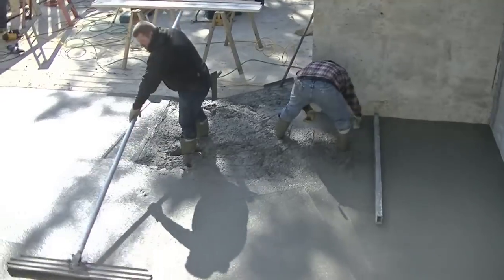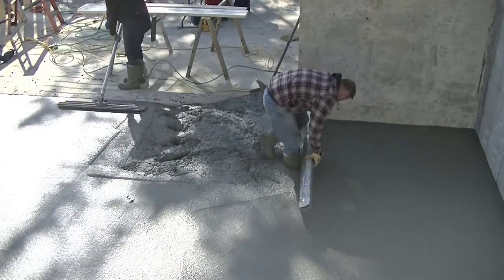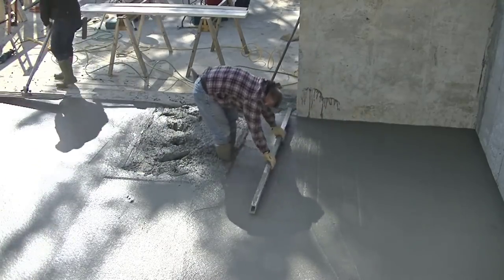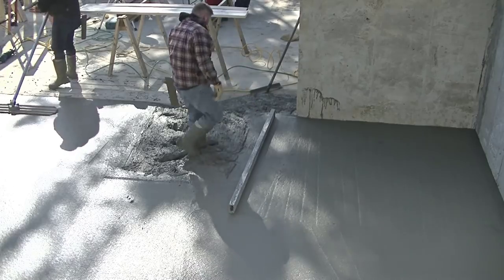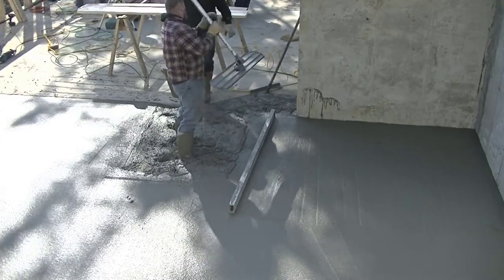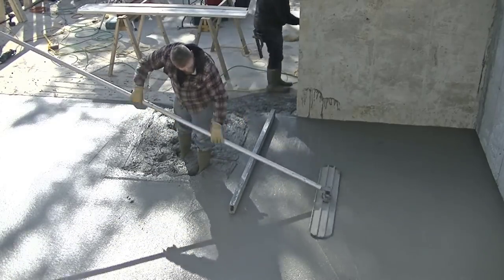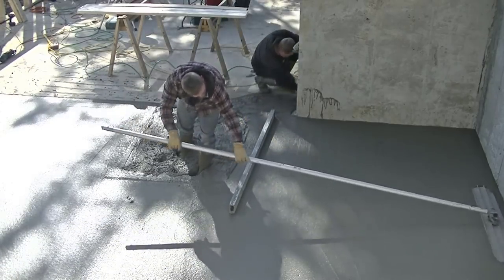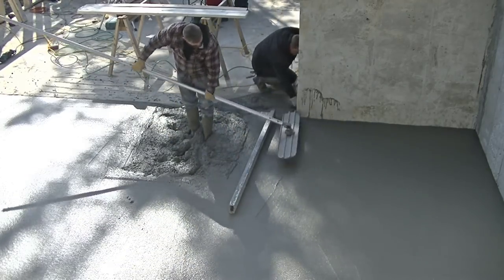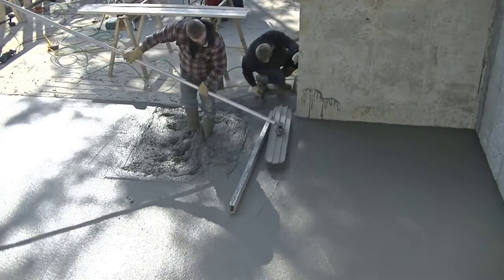You can see the little different angle now with the sun shining. The guys in the background were doing the framing on this, so they really needed this done before they could frame it — otherwise we would have had a much more difficult time pouring this. Darren's just finishing up with a 7-foot screed and he's got to get that corner bull floated before he can turn and come down the other way. Luke's magging out a little piece that they had to break out for some plumbing, just going to flush that back in even with the other floor.